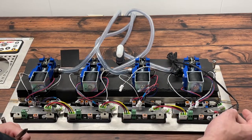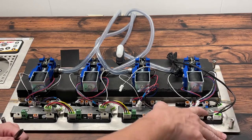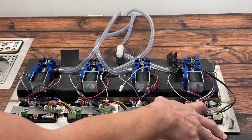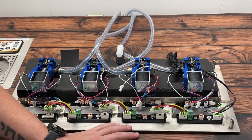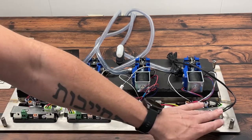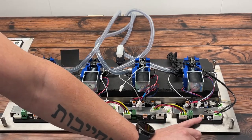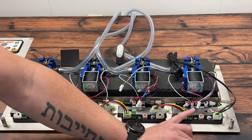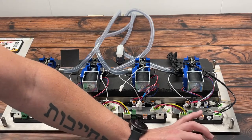The next step is to power up the first circuit board, making sure that the little ground eye is connected. This is very important — it connects to the bracket here that also neutralizes any ground currents in the chassis itself. Now that the circuit board is plugged back in, check whether or not it will power up: make sure the lights come on, that it allows you to change from pour mode to program mode to prime mode, and that everything is working.